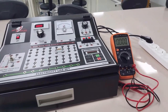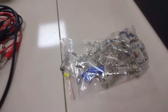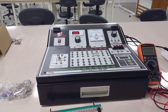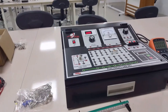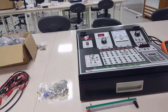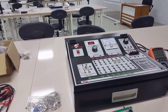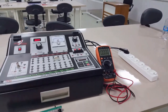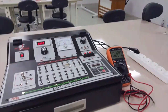As fundamental equipment for this experiment, here you see a multimeter, circuit elements in the back, and necessary connection cables. As theory, in all the experiments, we will be using some sort of test equipment to measure aspects of electricity that you cannot directly see, feel, hear, taste, or smell. Electricity is insensible by our human bodies. Your most fundamental eyes in the world of electricity and electronics will be a device called a multimeter. Multimeters indicate the presence of and measure the quantity of electrical properties such as voltage, current, and resistance.